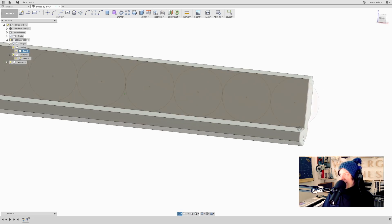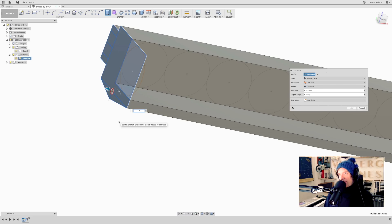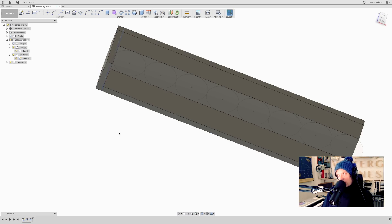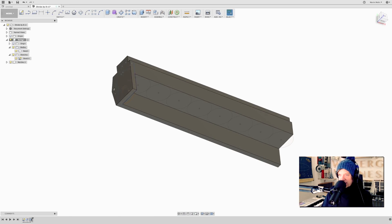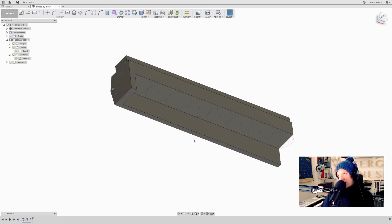See how that looks? Yeah, this is something like it. Let's extrude the back wall three millimeters. The wall is going to take some beating over the years, so let's go back and edit that feature and instead choose four millimeters — strengthening up this wall a little bit.